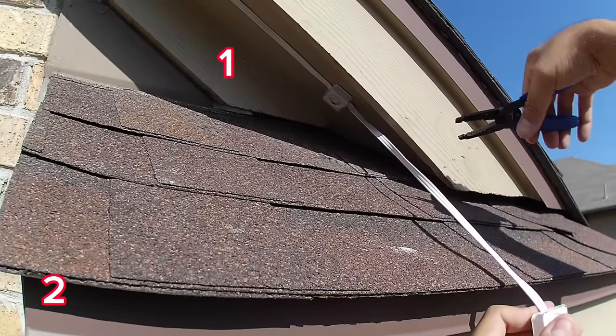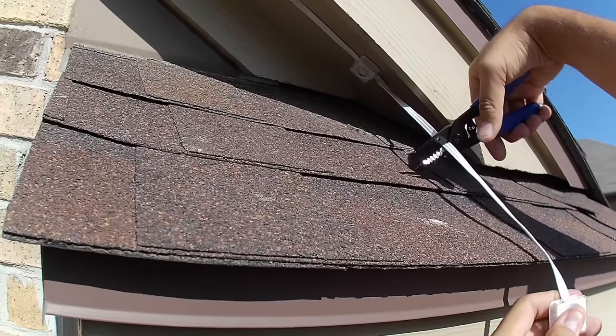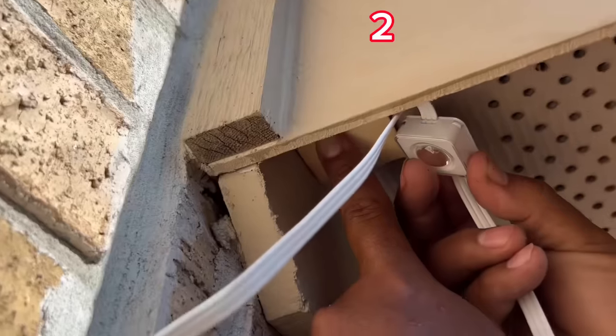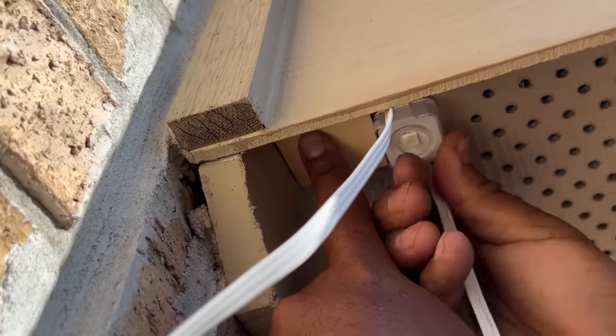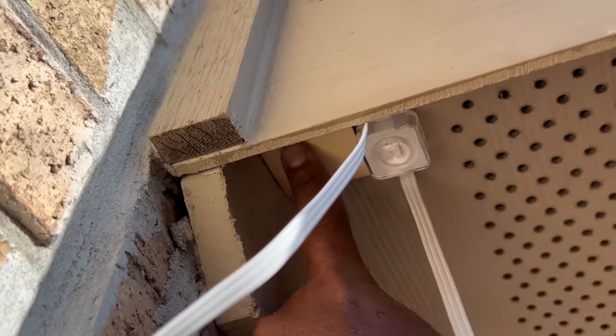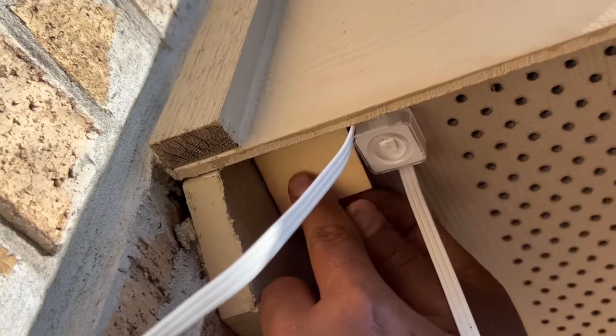It's time for our first cut. Using some wire cutters, make the cut between the two lights so you leave enough room for the heat shrink sleeve. Take the drop-off strand down to the next eave. We will eventually drill a 5/16 hole to pass the line through. This will be shown later in the video.